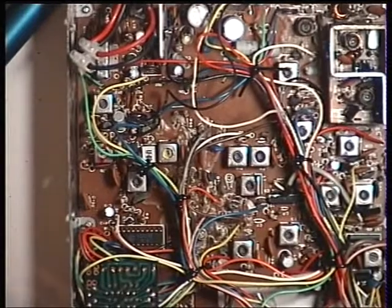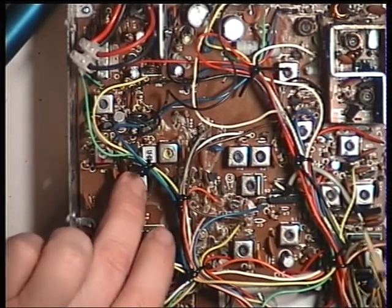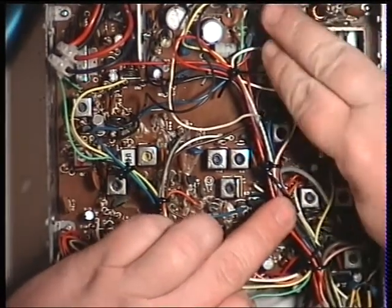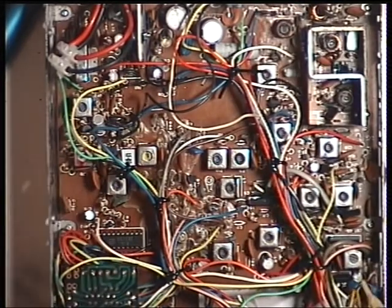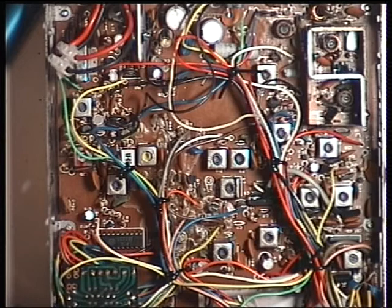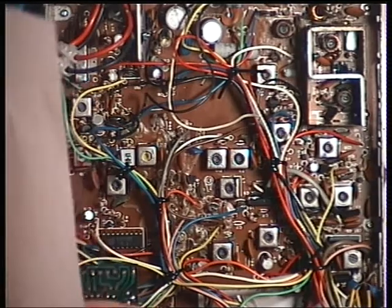Okay, proceeding on to the receive now of the World Sound PT40. So we've covered the fact we've got a service manual for the low TX40, which is electrically very similar, but it's a totally different layout. And we've already worked out that that's got to be the VCO coil there. That and that are transmit, and obviously the ones at that end. But it leaves us quite a few. That's going to be detector. It leaves us quite a few we're guessing at. And I don't like guessing games on these. It's not really very professional.